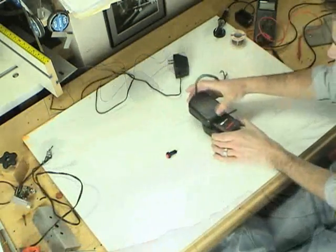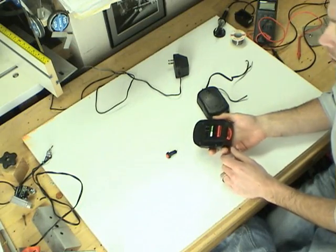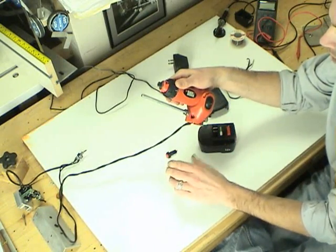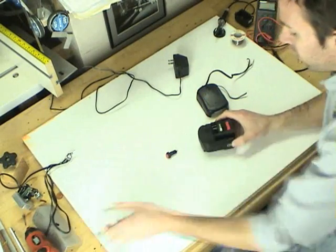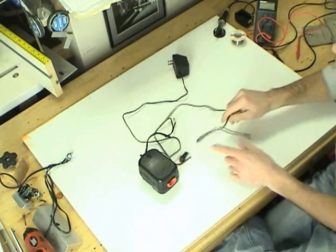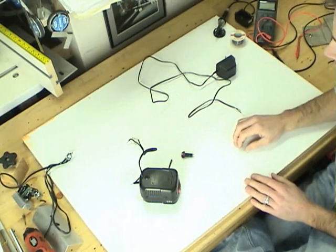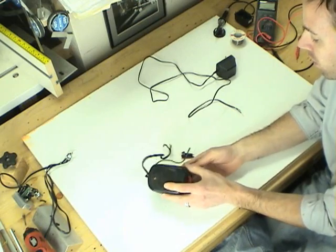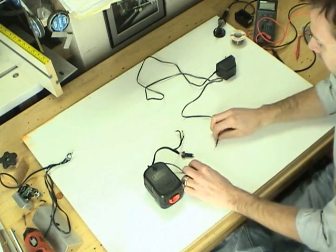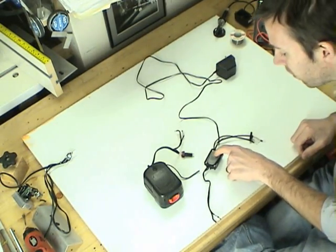Let's begin by looking at the battery. This is the battery that used to clip onto the bottom of this particular powered screwdriver. There's quite a bit missing from the powered screwdriver — this used to have an arm that came down and the battery would clip on the bottom. The battery is a 12-volt battery. The way it was charged, you slide it into this charger, which was connected to a small AC-DC transformer that plugged into the wall. We're going to keep this as the power source for the motorized router lift, so we don't have to take out the battery and charge it all the time. We're going to connect it to the AC-DC transformer all the time with a little switch, so we'll leave it plugged in, and when we want to charge it, we'll turn it on.